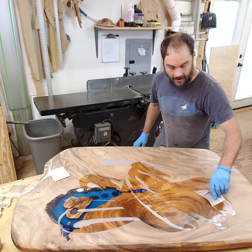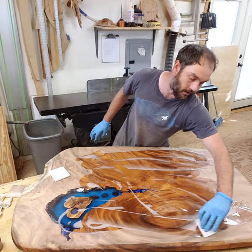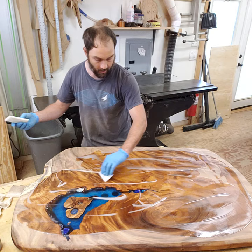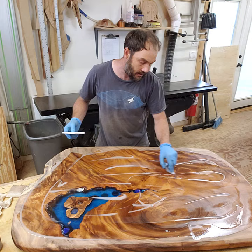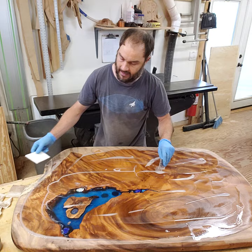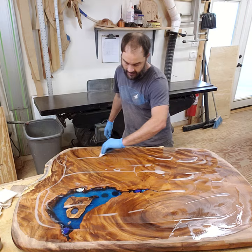I'm just floating this card around — not trying to scrape it, this is just for distribution. You can see the color comes out pretty quickly; you immediately get that oil color which is nice. Start slow and add more as you go — it's better to add more than to have a puddle, because this is not a super cheap finish. It is a pretty expensive finish, but this is a pretty expensive table, so I want a nice finish for a nice piece of furniture that's going to really last. I can see it soaking in — little puddles in some places, but in other places it just goes right in.